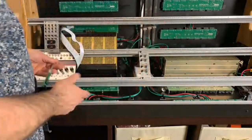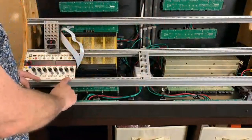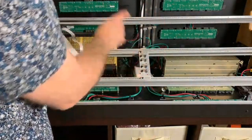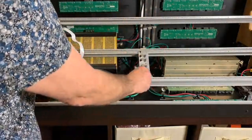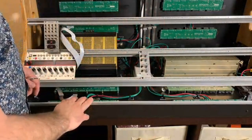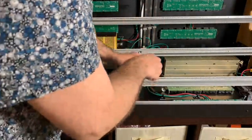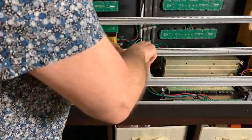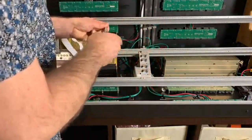What about you on this one? I've got some problems. It gives me problems because some modules have slots and some, like the Doepfers, just have that hole. So I'm keeping my screws purposely loose right now so I can slide things in, to make sure I can get modules in next to each other, because I'm going to run into some spacing problem here at some point. And since I don't know exactly where this module is going yet, I have to put in the other modules to its left. I'm going to take out the nuts for now and slide it all into place later on.